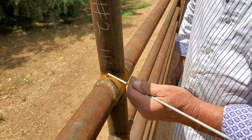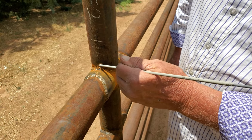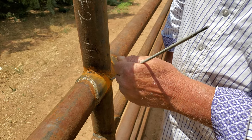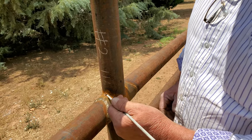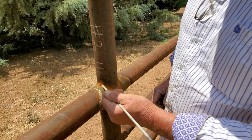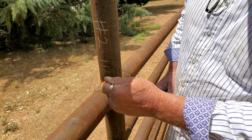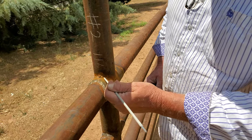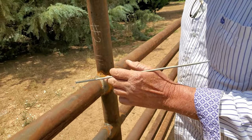Same thing up on the post — I'm clear up into here and it's sucking it down into the fitting, so I don't have to worry about it blowing out. That was his problem too: without the fittings, the pipe blows and you need two sticks of rod to get one to stick, it looks like hell, you got to grind it off, and then finally it'll start sealing itself shut. You don't want to fight that.